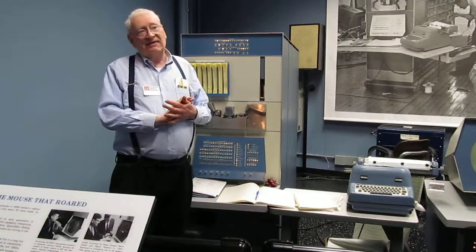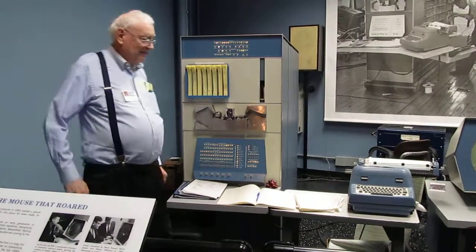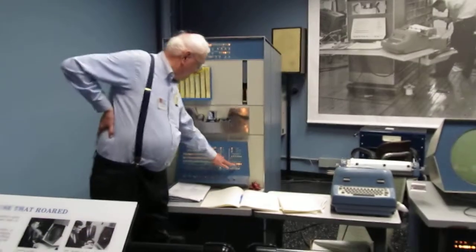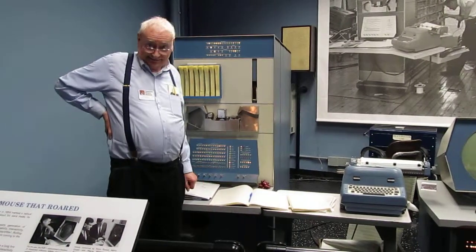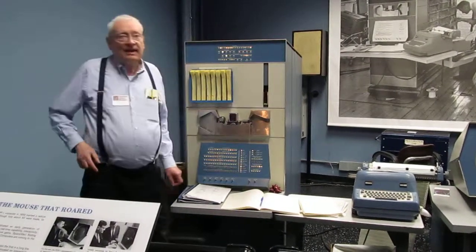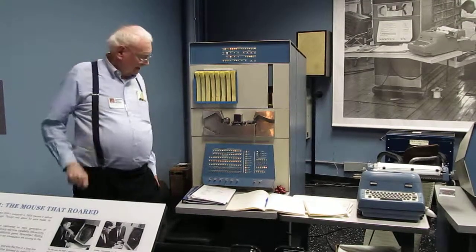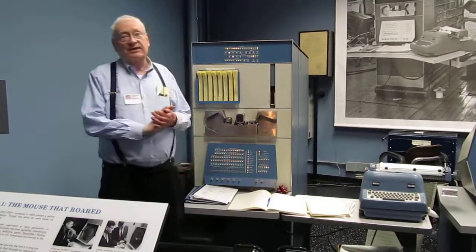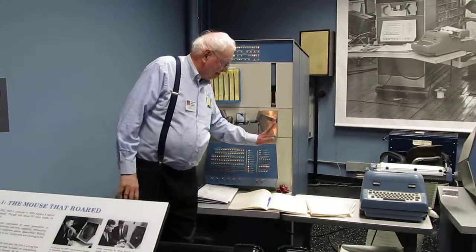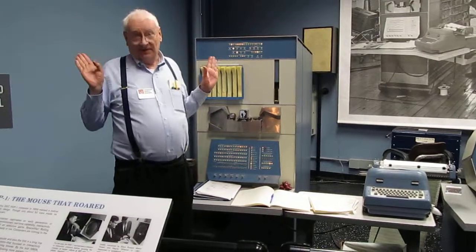Now, granted that I don't have any special music-making hardware — what do I have? After negotiation, what they let me do is connect wires and four light bulbs on the front panel. The thing has six program flags, and each of these can be separately turned on or off by a software instruction. So I took the first four and called them soprano, alto, tenor, and bass. Four light bulbs, four wires, four resistors, four capacitors — that's my interface.